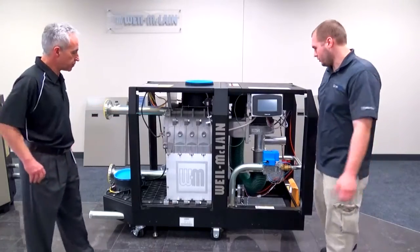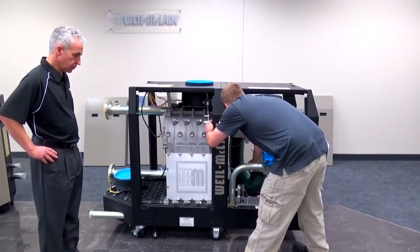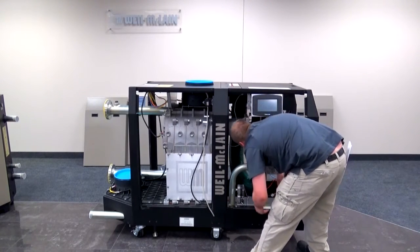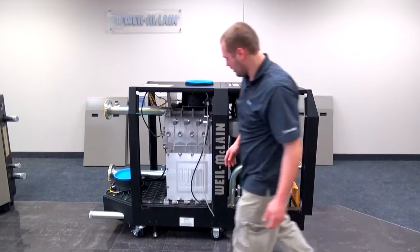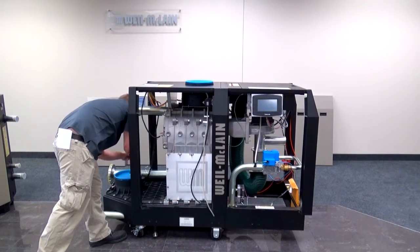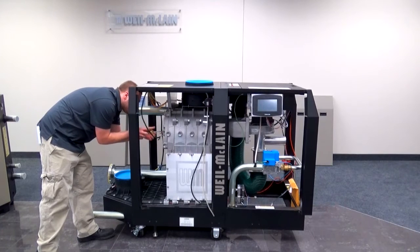All right, the very first thing you're going to want to do is a rundown and disconnect any wire that's attached to the top frame. That would be even your igniter. You want to remove your hoses, so the pressure switch. The wire to the gas valve and gas pressure switch. To the other side of the flame sensor, your supply and return sensor, and your flow temperature sensor. Then you'll need to grab your Phillips, disconnect the ground wire from both your flame and your igniter.